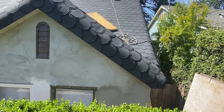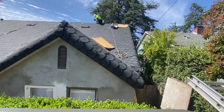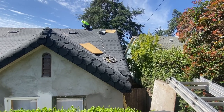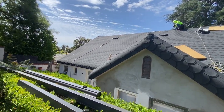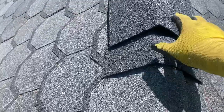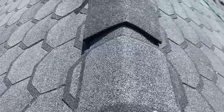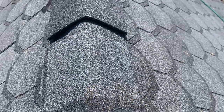On the sides I wrapped it around and it looks like this. It took me about three to four days each side. I had to snap chalk lines across the roof to make sure every course was straight, because these are expensive shingles.